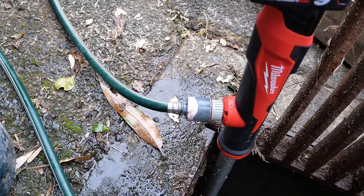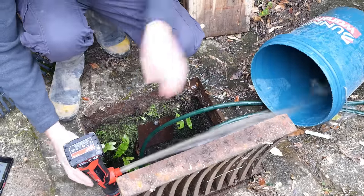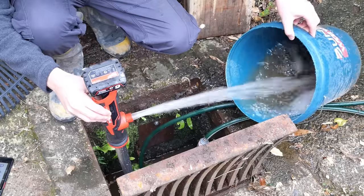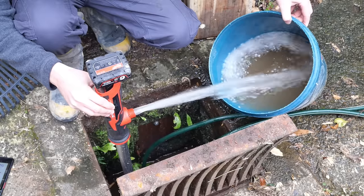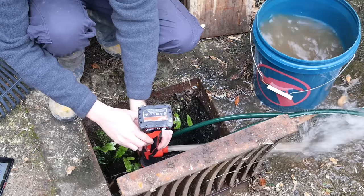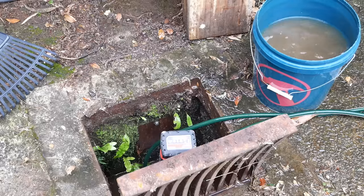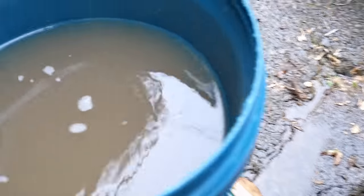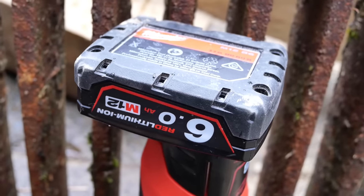Can I do it just coming straight out of there with no restriction? It's going to get messy. Well, that was about three quarters of a bucket in 22-ish seconds — so much, much better, much more in line with the 34 litres per minute rating. So firing straight out of there is how they get the maximum flow rates. As you've just seen, going through the hose we're looking at half, or even maybe only a third, of those numbers.